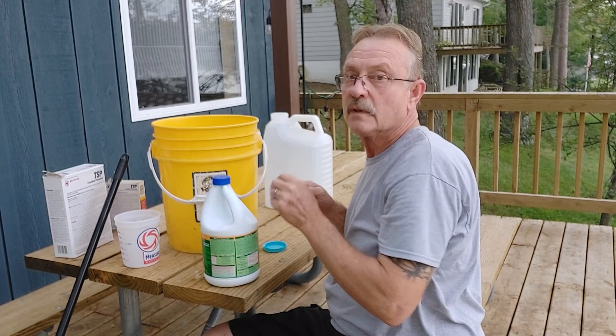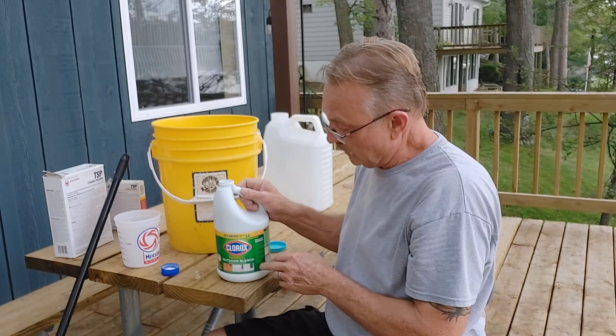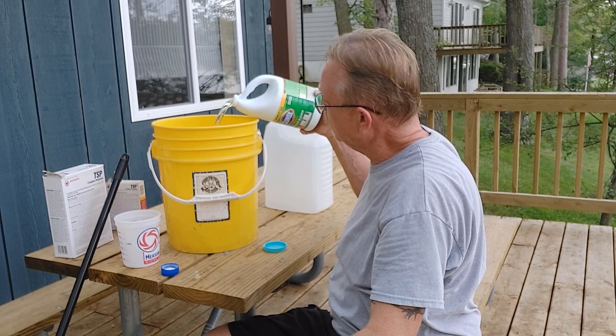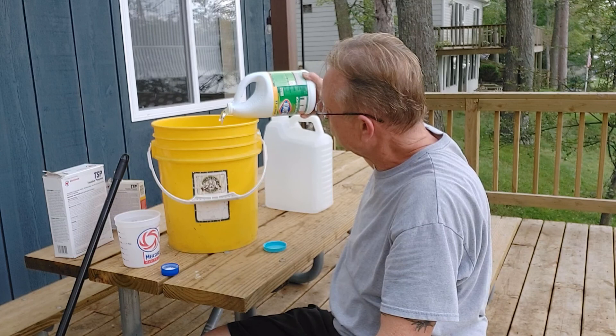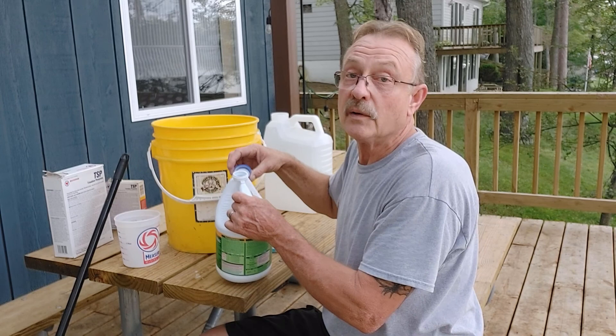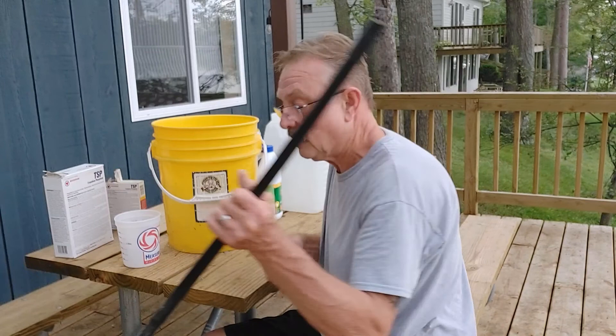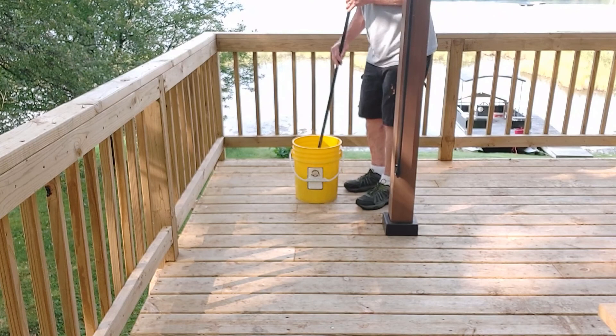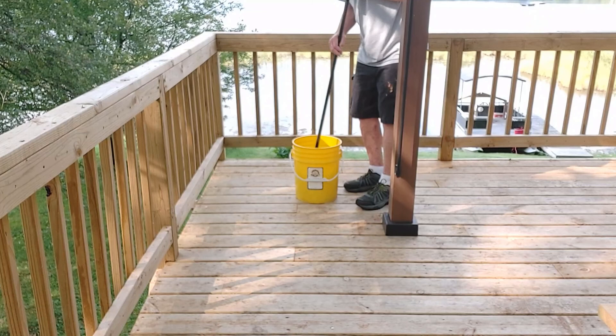I went and put some grungy clothes on because I'm going to be messing with bleach. This container is actually 2.53 quarts, so it's going to be a half a quart short, but I'm not too worried about it — I think we'll be just fine. I'm going to put this entire container in just like that and we are ready to go. I'll be using this to apply it and scrub it a bit. I'll do about a quarter section of the deck at a time. There's not too much sun right now so I'm hopeful it doesn't dry up before I can rinse it off. Just going to give it a little stir to make sure everything is well dissolved.